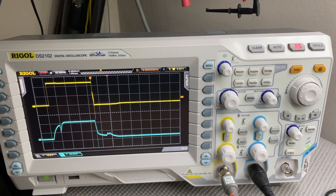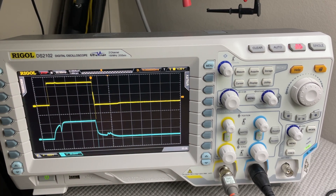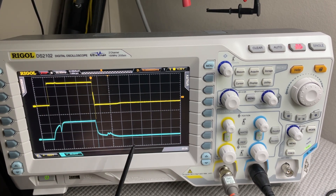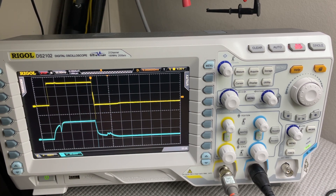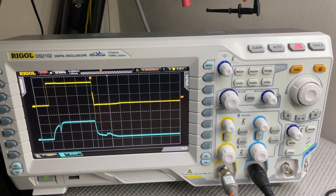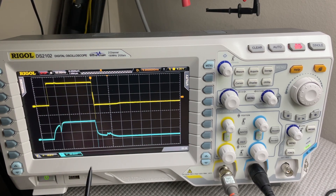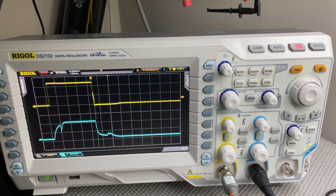We get a decay of current down towards zero until the magnetic field forces have collapsed to the point where the armature can move. We get a rise in current due to the induced effects of the changing inductance as the armature moves in the magnetic field. Once the armature finishes moving, current continues to decay to zero. The blipping current with the double bump is probably due to the stiff spring — when the magnetic force initially collapses, the spring moves a little but loses force, gets hung by the magnetic field, then collapses further allowing the spring to return the armature to initial position — a bouncing of the armature in the collapsing field.